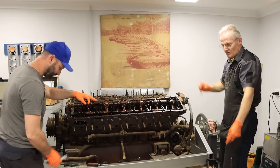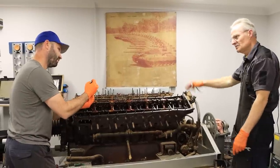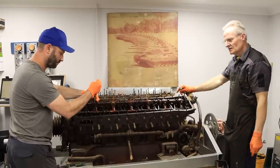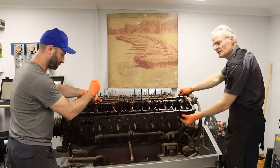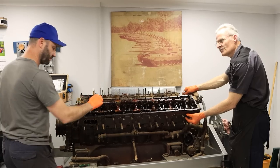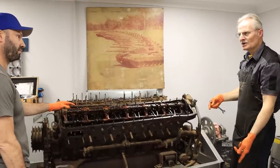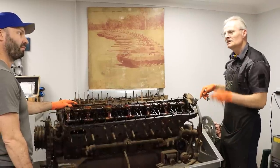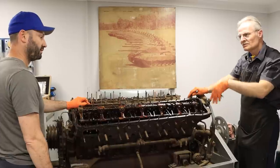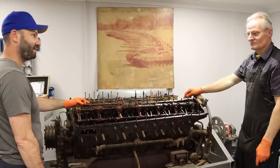When I looked at the dynamometer, there was a very large electric motor with a series of big V-belts driving onto the back of the water brake coupling between the engine and the dynamometer. I asked what the electric motor was used for, and they said: for the Meteors, there's a chrome section of the cylinder liner at the top of the bore — a very thin layer of chrome. They used to take the spark plugs out and wind them over with the electric motor for 24 hours before firing them, to get initial bedding-in of the rings in the chrome, because the chrome is so hard. I was blown away — that's a process you wouldn't anticipate having to do.